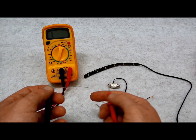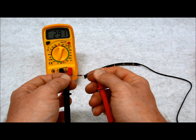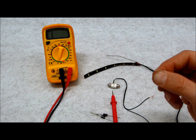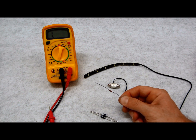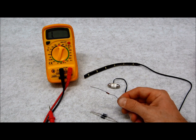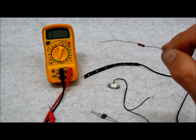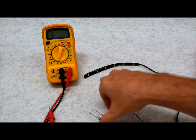For my demonstration I only recommend using a resistor. I have my meter set on resistance under 2000 ohms and I'm reading about 0.290, so this is about 300 ohms. I do not recommend using anything higher than 600 ohms for this application. The lower the resistance, the higher the wattage output you're going to get. It's fine to experiment between 250 and 600 ohms, but anything above or below that I don't suggest. That's all I can do — tell you what I think you should do.